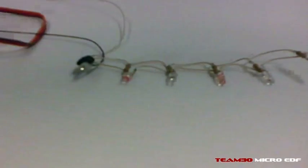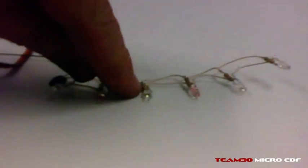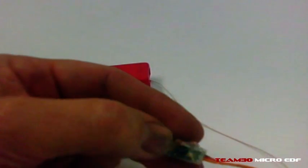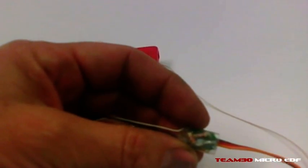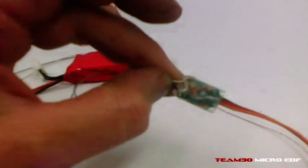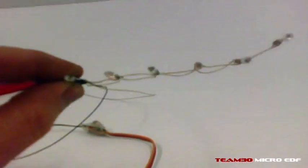My plan is to take the voltage from the receiver at 5 volts, and I've stepped it down to the required voltage using resistors. The driving board is a HXT 900 servo. What I did is, when I removed the pot — which I measured at 5k — I simulated the pot being in the central, or neutral, position, and took the closest resistors I could find, which was 2.7k, and soldered them onto the board to mimic the pot being centered. The motor driver wires came off, and I hooked the LED system onto that.